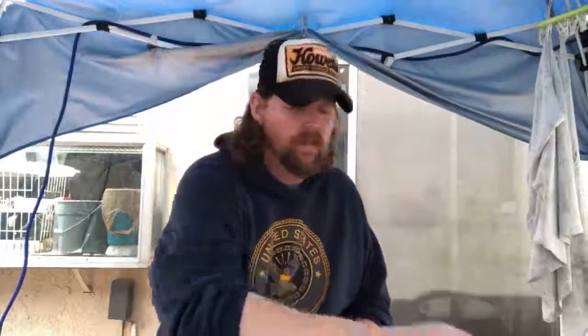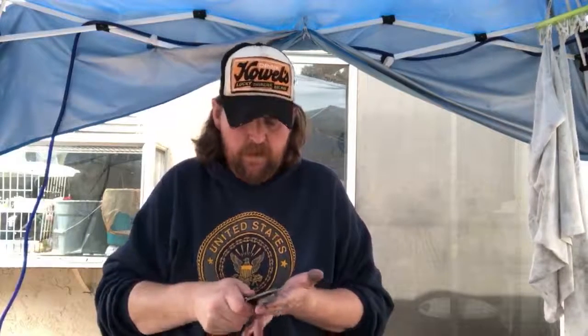I can get a 300 grit edge every bit as sharp as the other one. It's just not going to be as refined. You can only get stuff so sharp. So I would do a couple stropping strips on it and then I would knock the burr off on something like this. But I've done 400 to 600 grit edges for fishermen that needed to cut bait, line, and things like that.